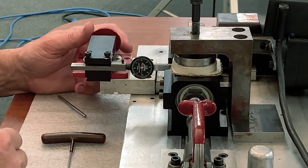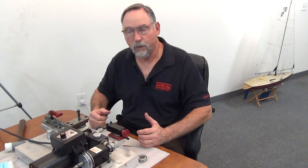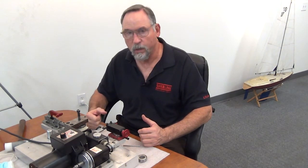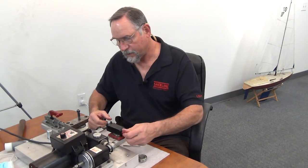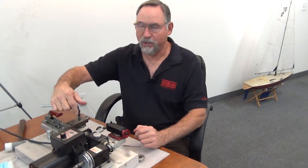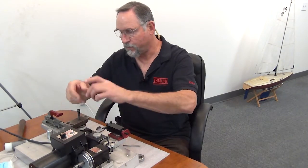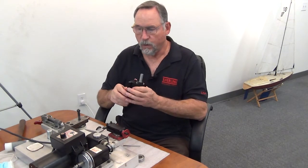After that tap, I'm at about six tenths right now. Six tenths is really not going to be noticeable on anything you run on this — especially on a mill with a 10,000 rpm spindle, which is basically for running small end mills or engraving bits. That six tenths is well within tolerance for a 10,000 rpm spindle. The instructions say three to four tenths, but you're probably not going to get three to four tenths with a tap at home. That five to six tenths will allow you to spin this at 10,000 rpms without frying your bearings.